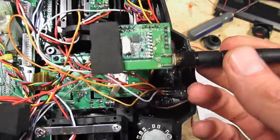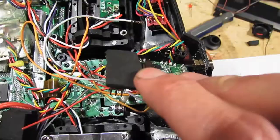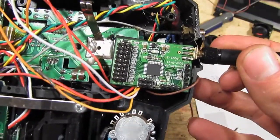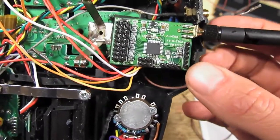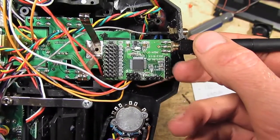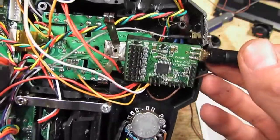The OpenLRS board — I've put a bit of foam padding from the packaging on the bottom, and this will mount with hot glue and sit about there. All the pins will be nice and accessible so I can configure it the way I need to — my ISP header and serial header. I think I can use either for programming.